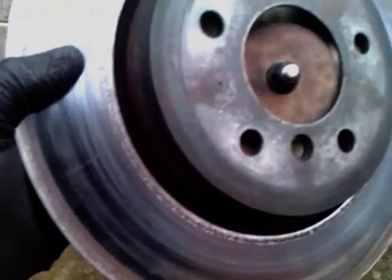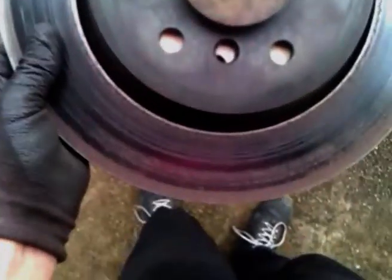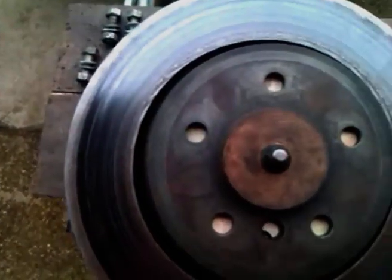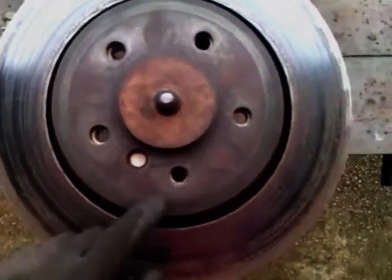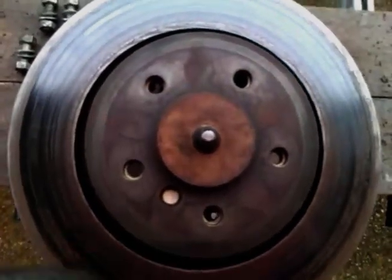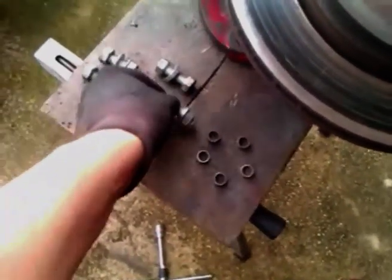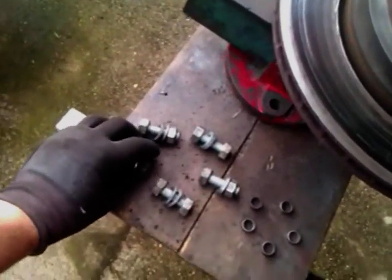I fitted the disc over and positioned it on one of the holes. You'll have to imagine at the moment that there's only one hole being drilled and the other four haven't been drilled yet. I've made five bolts. I didn't have any bolts this size, so I made five bolts using threaded bar and nuts and welded the nuts on the end. The other nuts are loose, obviously.